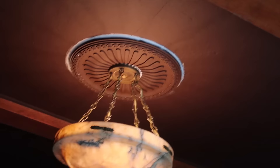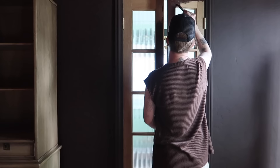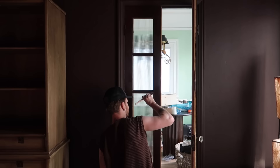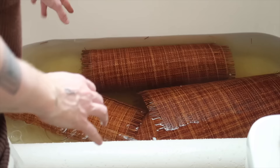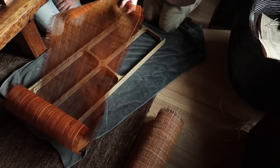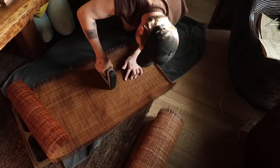It's like we're in the lobby of the movie theater right now. I cut down the cane rattan to the size of the doors and added two inches on either side. I cut out four panels of this so that I could soak it in the bathtub. You actually want to soak your rattan material, especially older cane like this — this is actually pretty old, that's why it's darker. Soaking the cane actually makes it quite a bit more pliable and stronger. When you put it in whatever you're using it for — whether it's a chair or a door like this one — once it actually dries down, it tightens itself up and shrinks to the size of the piece, so it really creates a clean finish in the end. However, this cane wasn't really going in as expected.